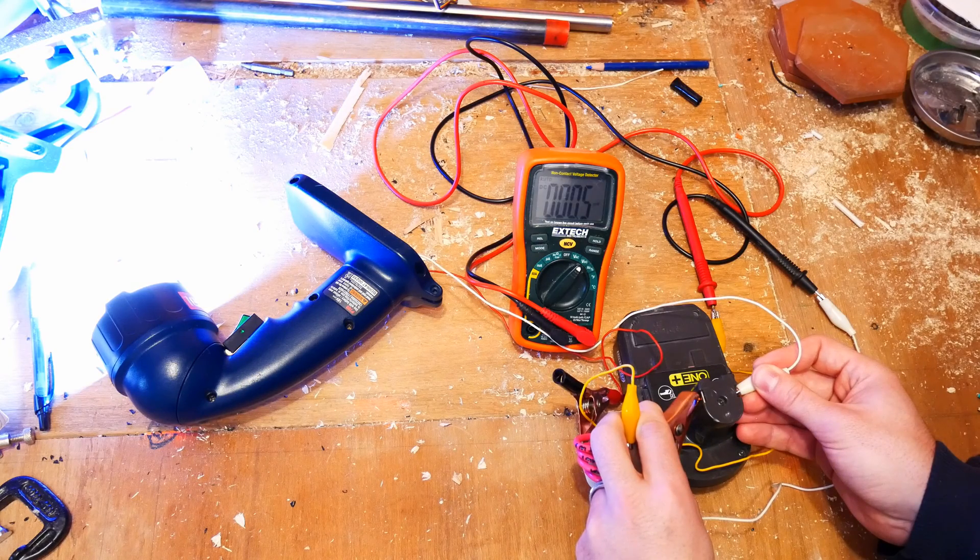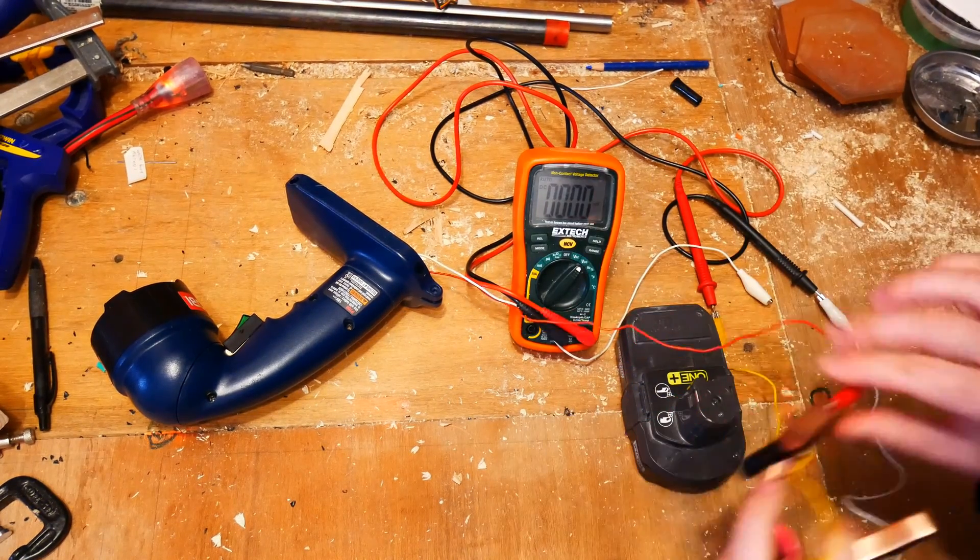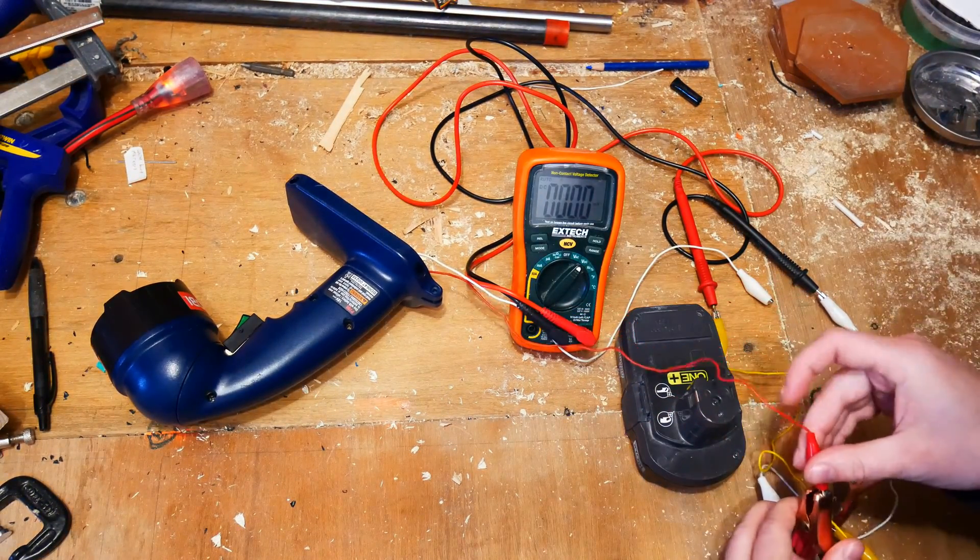There you go — what we can see is this is half a millivolt, so it's half an amp. Of course, this device would have been able to measure half an amp on its own, but this is just a demo.